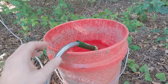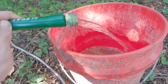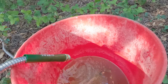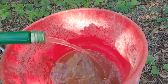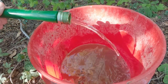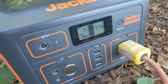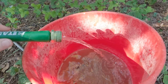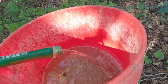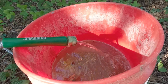The water almost looks clean enough to drink. Let's see how long it takes to fill that bucket up — it's starting to look clear now. So the question is: is the slow flow because the Jackery isn't powerful enough, the pump isn't powerful enough, or the small hose diameter? I think it's not the Jackery's fault, because the Jackery can put out way more than 260 watts — it peaks at 1000 watts and it's not even pulling 500, which is its rated continuous output. Some of it might also be this extension cord.